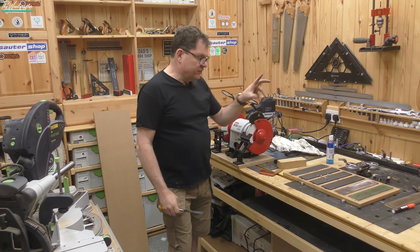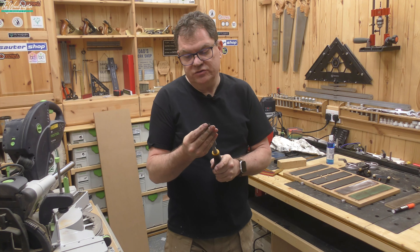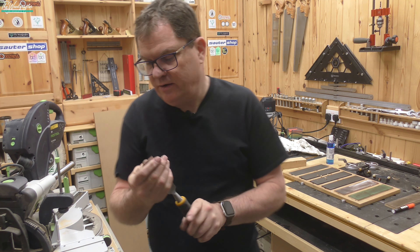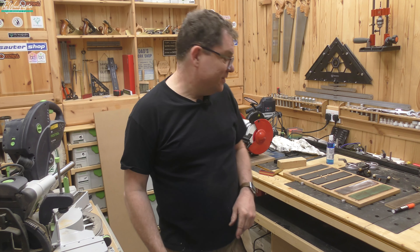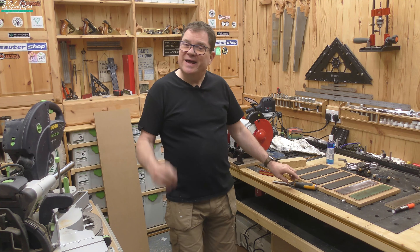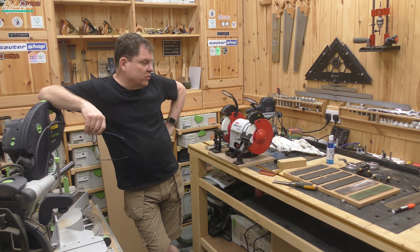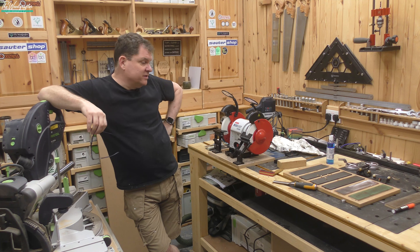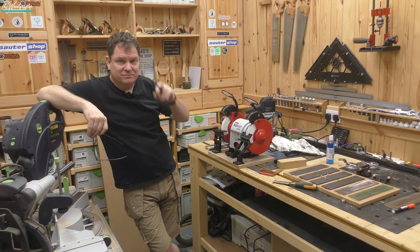All I've got to do now is sharpen all my chisels to get them where they need to be. Next time I want to talk about planes — plane blades are very very similar but there are some subtle differences worth knowing about. That may have seemed like a lot of work to sharpen a bargain-basement JCB chisel, but you don't have to go through that process every single time. The grinder and back-flattening stages are done — going forward, all I need to do is maintain that 30-degree secondary bevel, and if I do it frequently enough I can do that on the strops alone. Hope you find this useful and I'll see you next time on the Woodcrafter — let's get those planes sharpened up.